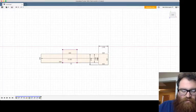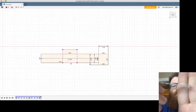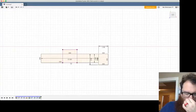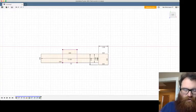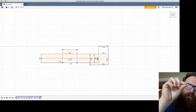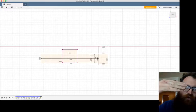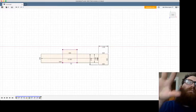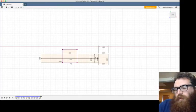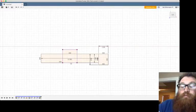And the ends of these guys aren't super clean. I cut them with a knife. So I don't know if you can see this, but the ends are a little crimped. So here's what I'm thinking. If this was a perfect piece of material, all we'd have to do is make that gap 0.3 millimeters and then do an arm across the front however wide, and it would just slip in there and it'd be a nice friction fit. That's impossible. Instead, what we might do is oversize it. It'll still probably fit,